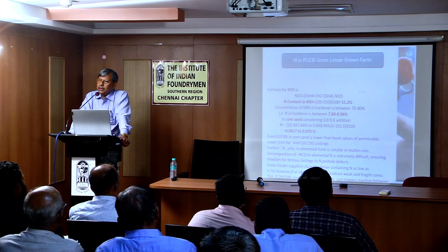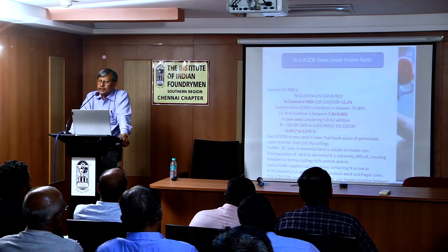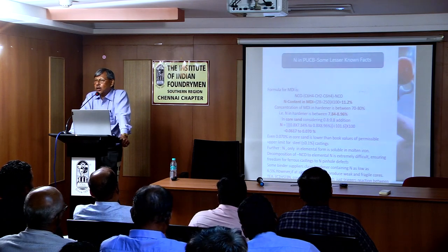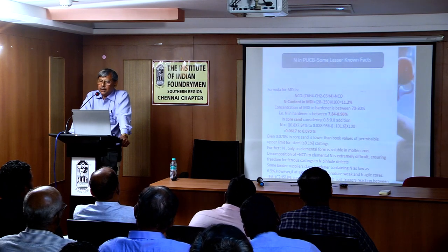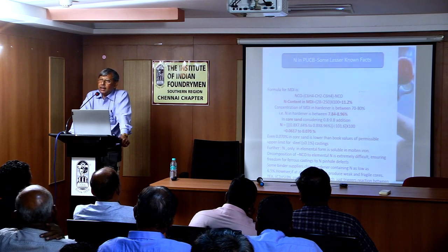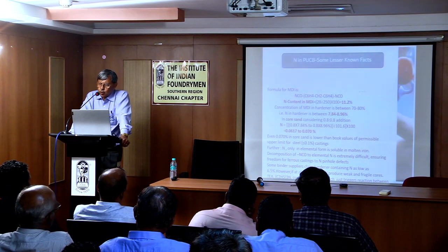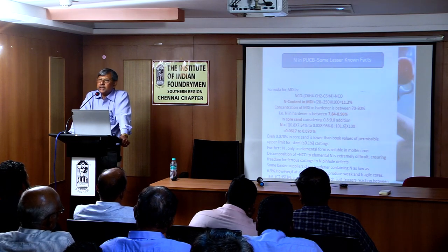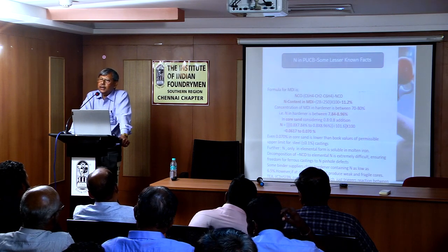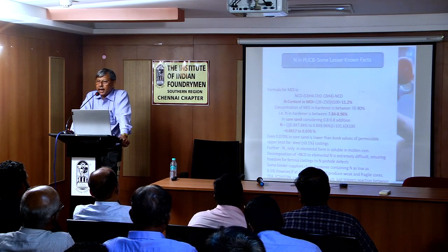In that case, there will be a lot of other issues related to strength and cores. Lower NCO, lower MDI, means there will be fragile cores, less strength. And higher means the immediate strength will be more, but later on there will be a drop in strength. But many sellers tell that my hardener contains as low as 6% or 6.2% nitrogen, but that is never practical, never possible, and never required, because it is an active component.